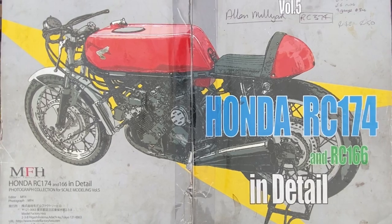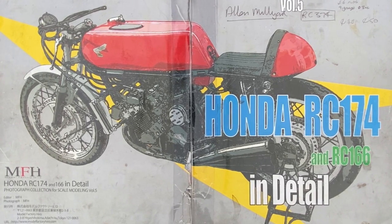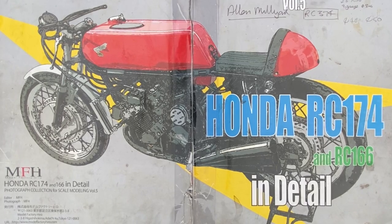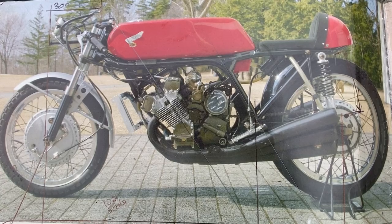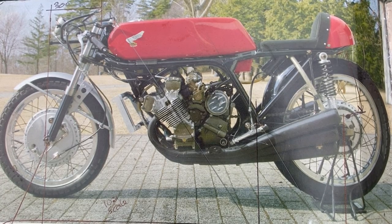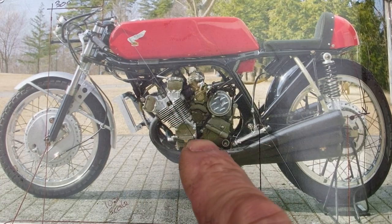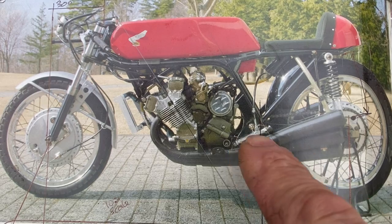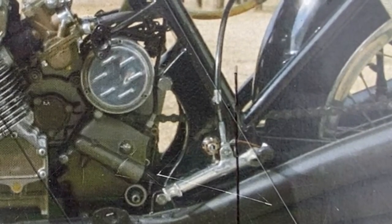With the engine running and the front and rear sub-assemblies complete, the next thing I needed to do was make a frame. I wanted the frame to be roughly the same as the real Honda RC174, so I bought a model maker's guide to making one. This gave me the critical dimensions, albeit a bit small, but I just scaled them up by my known size which was the outside diameter of the wheel rim. I then measured the angle for the steering head and the angle of the engine leaning forward, the distances between the rear wheel spindle, the swinging arm pivot and the engine sprocket, and from that I could make my frame jig.